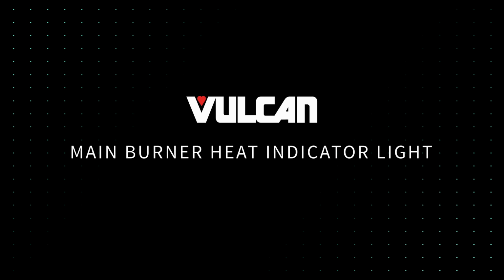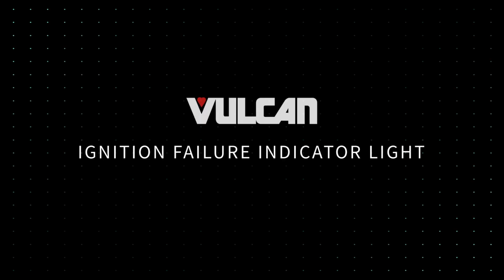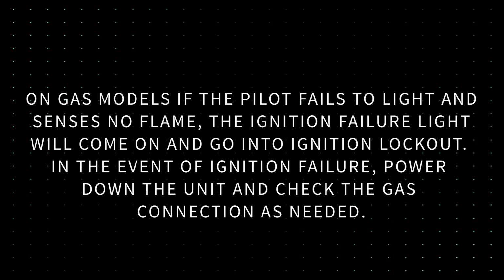Main burner heat indicator light. When the main burner heat indicator light is on, the main burner is providing heat to the kettle. Ignition failure indicator light. On gas models, if the pilot fails to light and senses no flame, the ignition failure light will come on and go into ignition lockout. In the event of ignition failure, power down the unit and check the gas connection as needed.